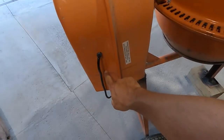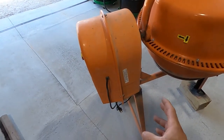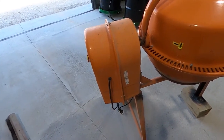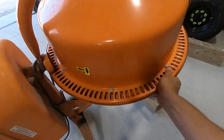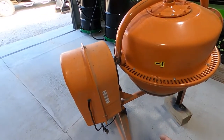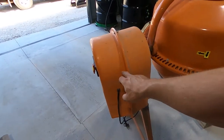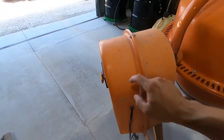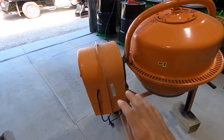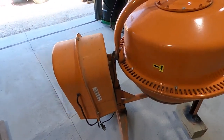There's a motor, and I imagine it's right here because the switch is here. There's also a belt and a pulley. The start capacitor on this motor can go bad — I've talked to quite a few people and ordered one myself. If the start capacitor goes bad, you can still start it by turning the switch on and manually rotating the drum, but don't keep doing that — power is going to the motor and if it's not starting up, it's just cooking itself. Get an extra start capacitor. You can check the Harbor Freight parts diagram for the size, then order it cheaper from eBay or Amazon.